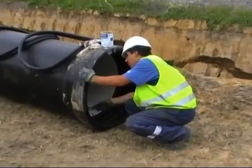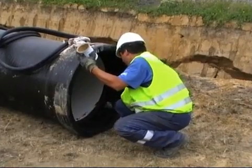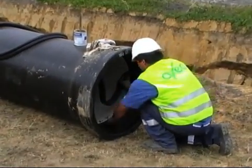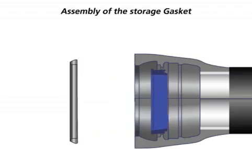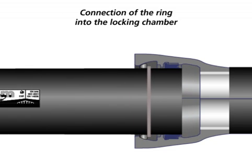Junctions are equipped with universal VE joints. This junction comprises two chambers: a sealing chamber fitted with a sealing gasket and an anchoring chamber fitted with a metal anchoring ring. The anchoring system prevents separation of the pipes when pulling forces are applied during installation, requiring no bolts or mated flanges.